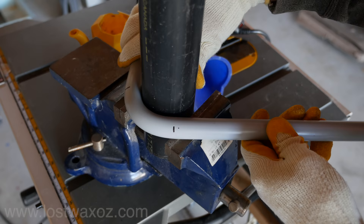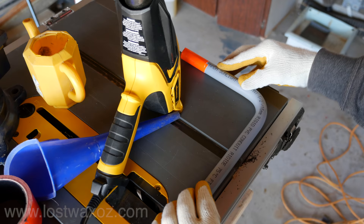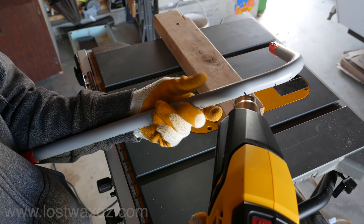When that time comes, set your heat gun down somewhere safe and quickly bend your pipe around the other pipe. You want as close to a 90-degree angle as possible. I used the corner of my table saw to check and make sure it was square. If not, you can heat it a little bit and try again. Now make a kind of T-square with two rulers and make a mark ten and a half centimeters up from the curved end of the pipe.